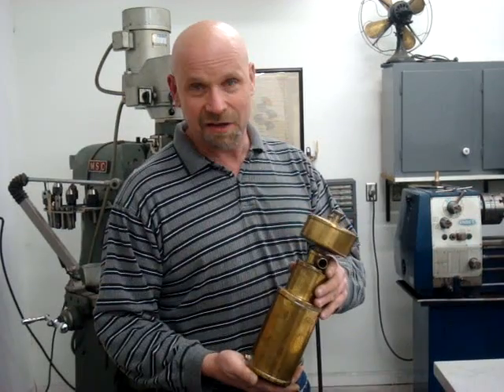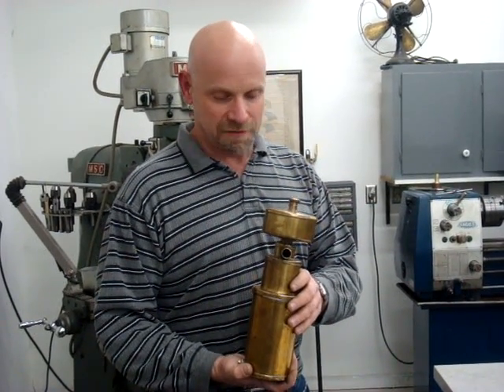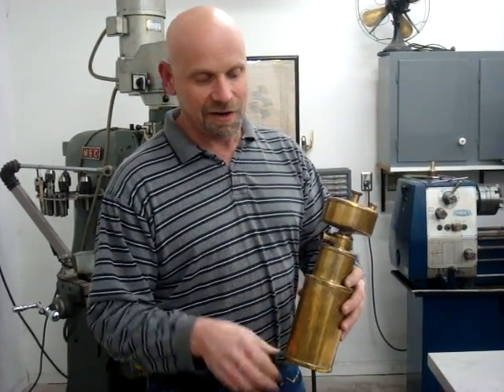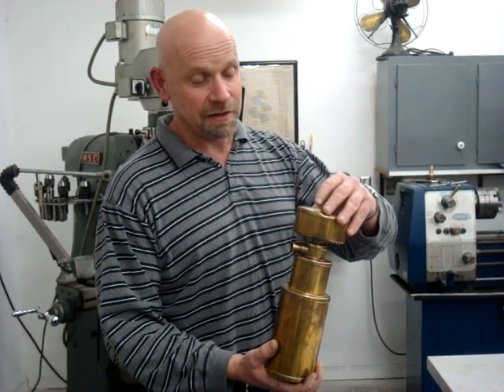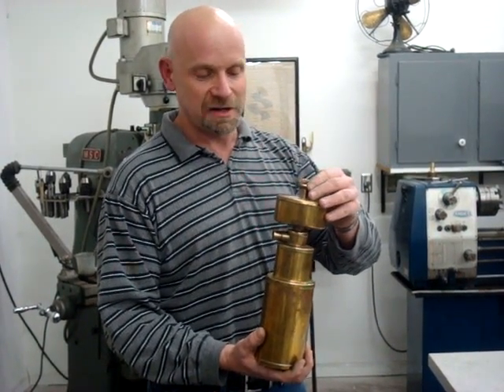This is the one that was supplied with the engine that Tom Stockton got when the engine was made for Tom Stockton Sr. The bottom part of this device is the flash carburetor, where air is bubbled through a level of gasoline, becomes enriched, and goes directly into the engine. The top part is a fuel source dedicated strictly for the torch on the hot tube.